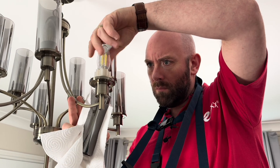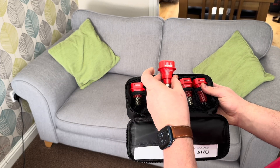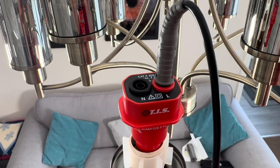But what if I carry out an EICR and I come across a nice set of fittings like this? As this is an EICR, I could agree with the customer that this is a limitation, but how can I be sure that it's not been installed by someone who isn't an electrician? Truth is, I can't — I need to ensure the installation is safe, not test the most convenient accessories. So the fitting needs to be tested. A great way to test a chandelier like this without actually having to remove it is by using adapters like this one from TIS. Simply screwing in the adapter into the fitting and placing my probes onto an exposed part of the luminaire will tell me if I have a protective conductor connected to this metal fitting.